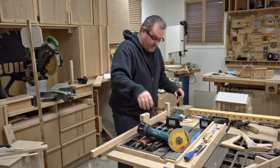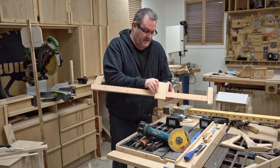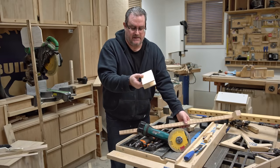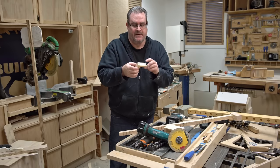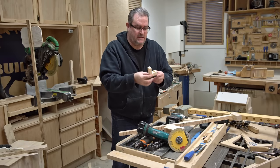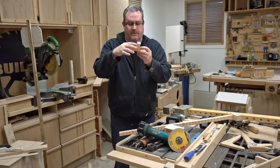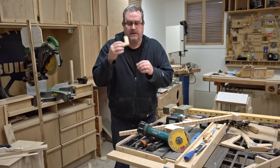It's the next day again — that makes it day four on this relatively simple project. I did some extra stuff yesterday: I let the glue dry for several hours and then came back and sanded it nice and smooth and clean — it looks pretty good. I also unscrewed the assembly and that glue joint immediately wasn't even holding, so I re-glued it with epoxy, because this arrangement has quite a bit of stress on it when clamping — especially when the lead screw is pushing up here, this part is meant to go forward.